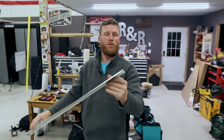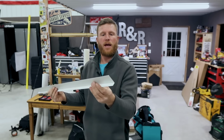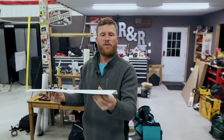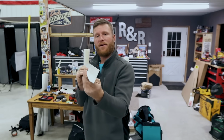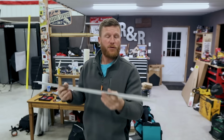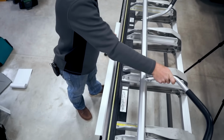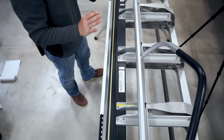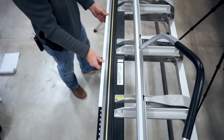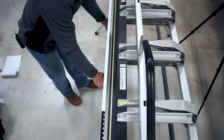We just bent the most simple of things, maybe a drip edge, a simple mini angle, or post trim, fascia, whatever. It's pretty simple. Now, if you were to take this exact same piece, stick it back in the brake, push it in till we get that hem tight to the edge of our brake, and tighten it back up.